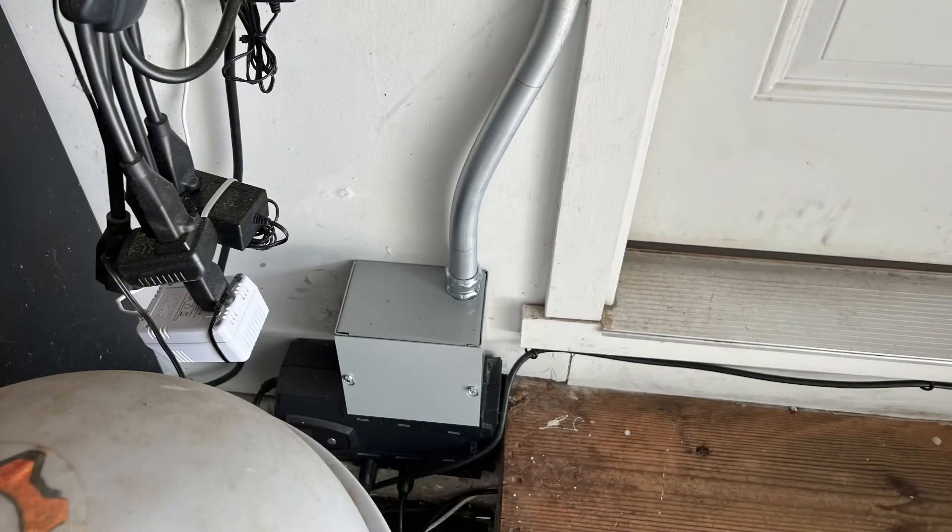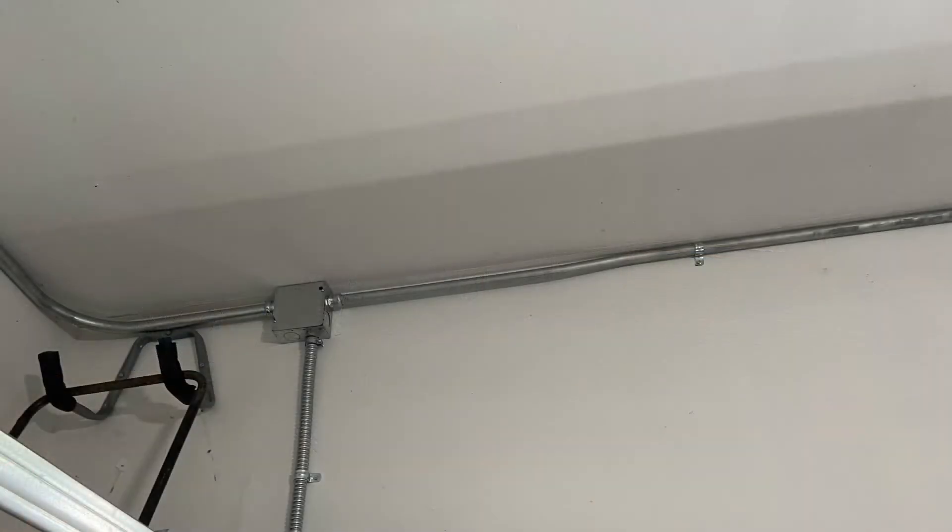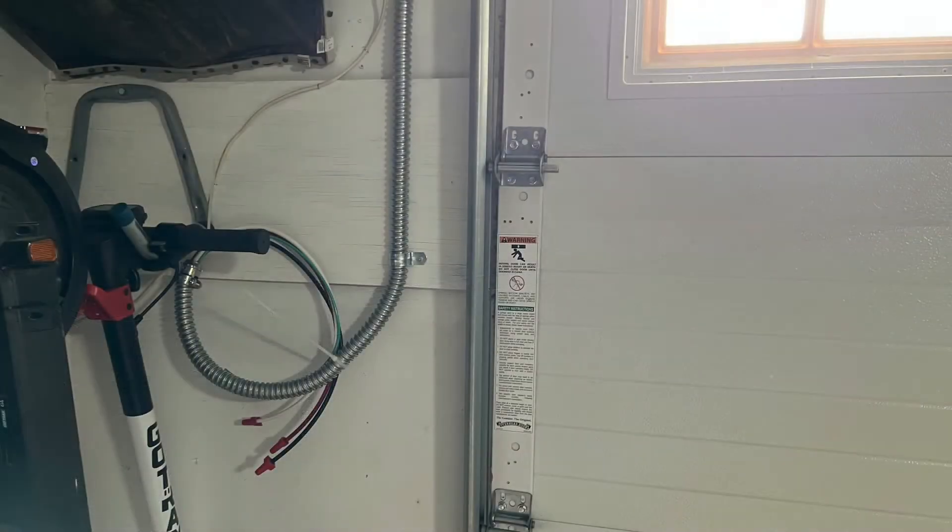You can see the wiring comes in from the basement, which is about 50 feet from the panel into the garage, into this little junction box. I installed two sets of wire, so we had to run the conduit with both wires up to the ceiling and across to both charger locations. I had to go with number 6 THHN with two hot, a neutral, and a ground. Neither one of these chargers requires the neutral wire, but maybe a future charger would. This ended up costing about $3,000 to run the wires in the conduit — I don't want to do this job again.